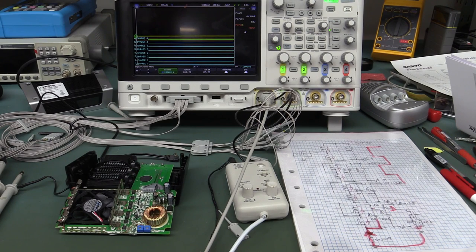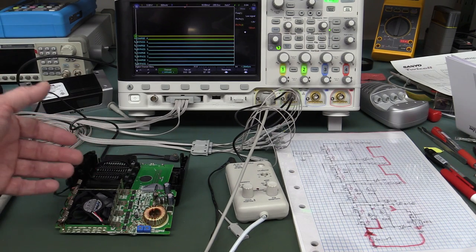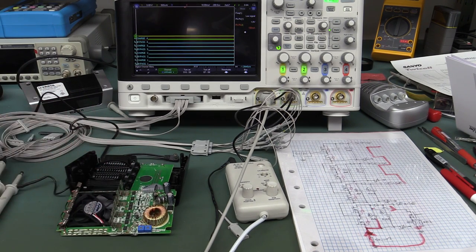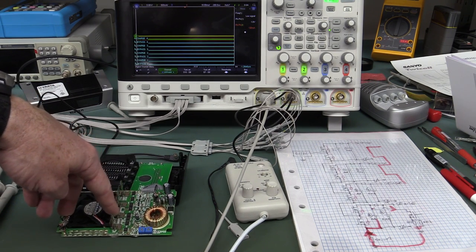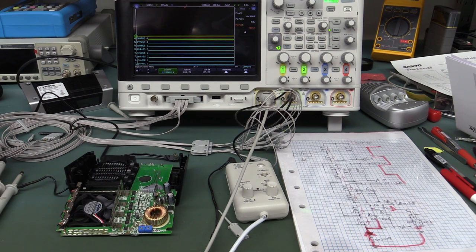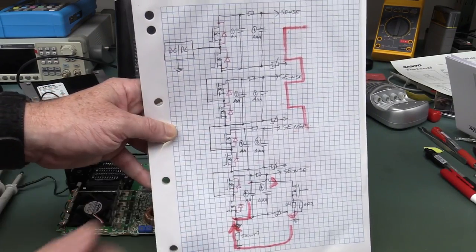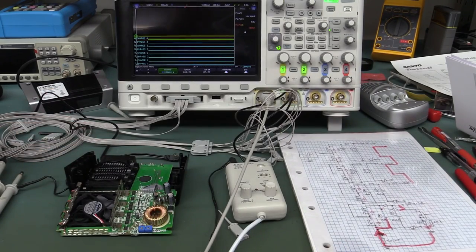I know I said this was going to be a quick video, but as always I got carried away and went down the rabbit hole. We eventually found out what the hell was happening: the charging is multiplexed, we found the discharge path, and we realized the voltage sensing isn't great — not terrific at all. It's kind of a clever design — I really like the way they've done the MOSFET switching — but in the end it's not a highly accurate implementation in terms of charging, voltage detection and that sort of thing. It's built down to a cost, and that's what you get.